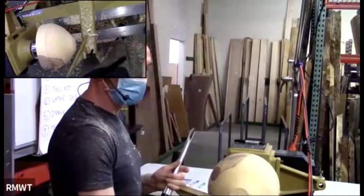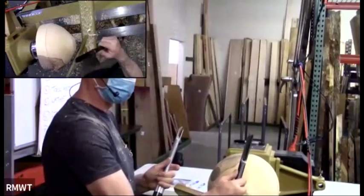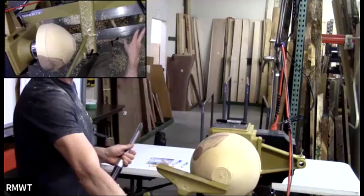The bottom bowl gouge could remove a bit of volume, but it can't do anything on end grain. It can only do it on side grain. So in bowl turning, there's barely any side grain. So, you know, this does like 5% of the work inside the bowl. Otherwise, this does all the work. So let me just show you what I'm going to do.